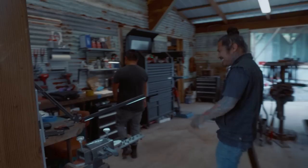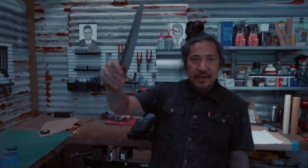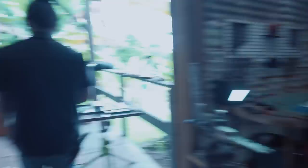It's proofed, it's sharp, it's ready to cut. The point of that paper cut is: one, it shows how smooth the edge is, and two, if it had that same bulky thick edge it wouldn't push through paper effortlessly. So it's a geometry test more than a sharpness test.